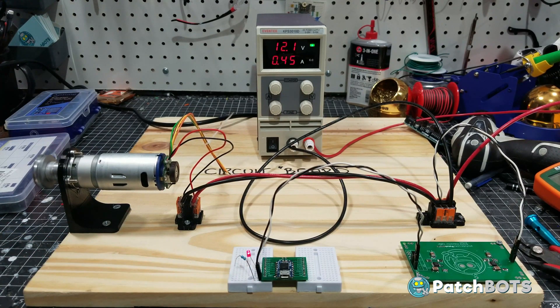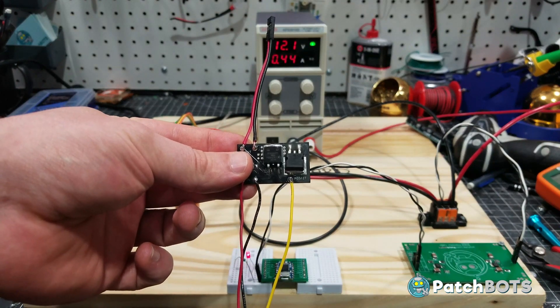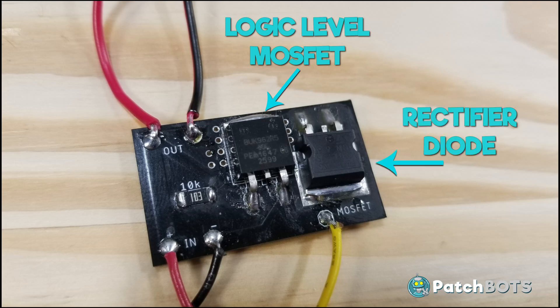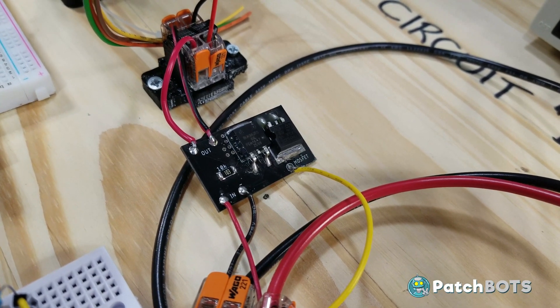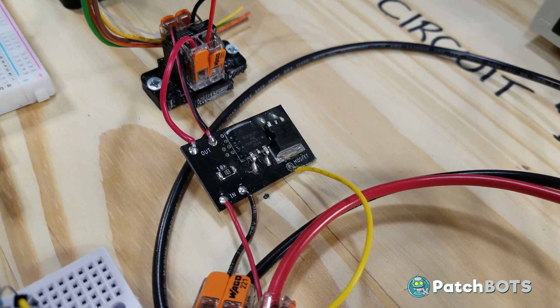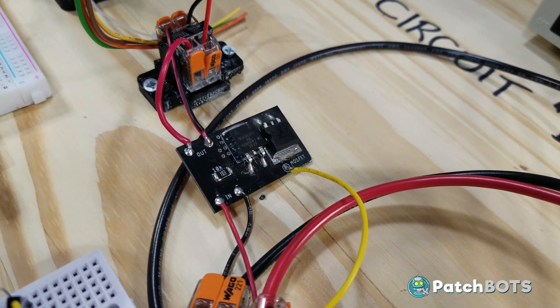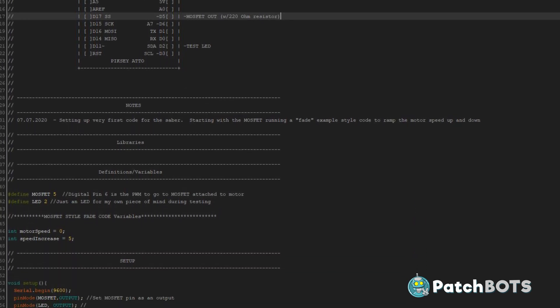I put a little indicator LED just so I know that it's running, because there's actually no on-board LED. Now that all of this is working, we can start using the microcontroller to control the motor. To do that we are going to use this little tester board I made consisting of a logic-level MOSFET and its accompanying rectifier diode. Think of this as a bare-bones motor controller — it will allow us to control the speed of the motor with a PWM signal from the Arduino, which is really all we need.